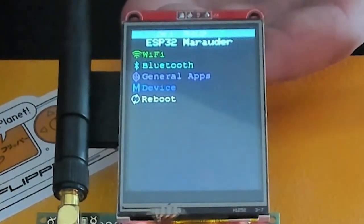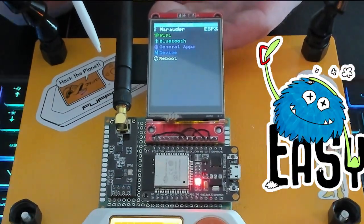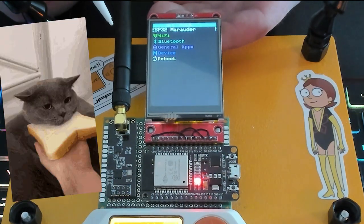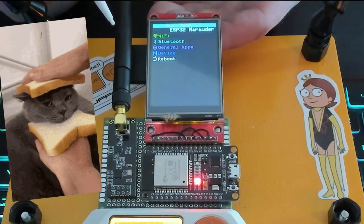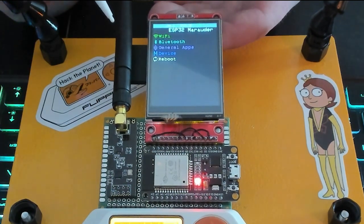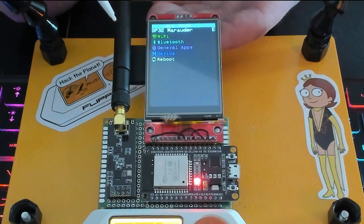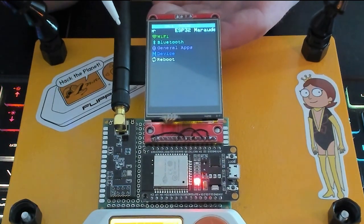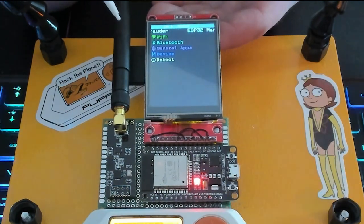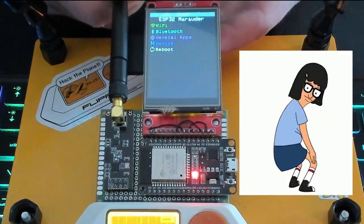It's a little ambitious, I'll give it that. However, you can build it without the NRF24, which makes it a little bit easier to wire. You can build it on a breadboard, which makes it a lot easier to figure out how to wire everything. I highly recommend using the breadboard before you go ahead and try to solder everything together. I didn't do it for my first few boards, and this one in particular took me a little bit of figuring out to get the wiring right. So I would not recommend just jumping in and trying to wire this whole thing without prototyping at all.